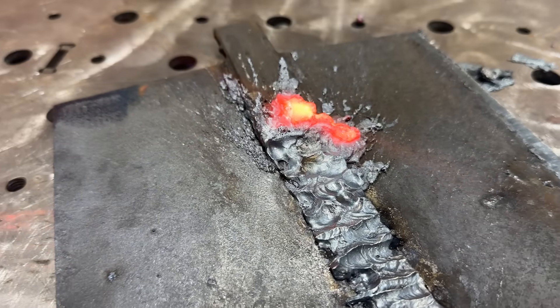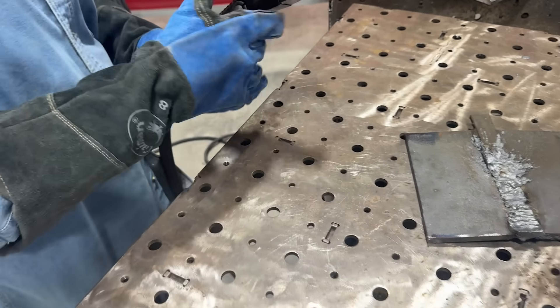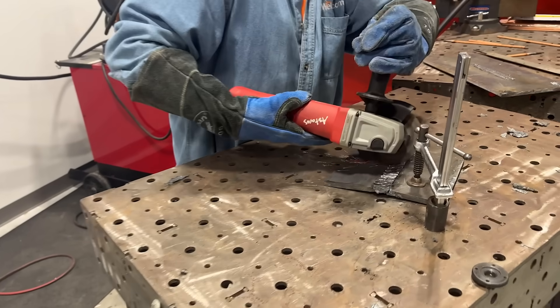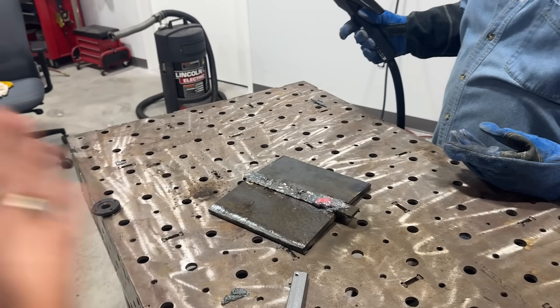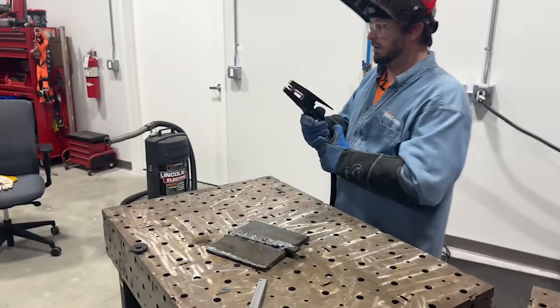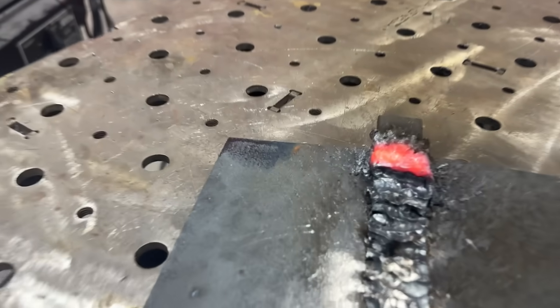That's the soup you want to avoid. As you start getting really close, there's an optimal distance — if you're too short you need to push some more electrode out. It's one of those times where there's enough material in the way, so go ahead and clean it up. You know how it's kind of sounding like it's stubbing out? Instead of floating it, you're pushing into it really hard. You've got to float it — feather it and float it on top of that surface. You're just grazing it; you're not trying to shove it in. All right, it's looking good — you're hogging it out.